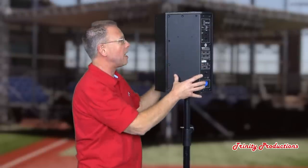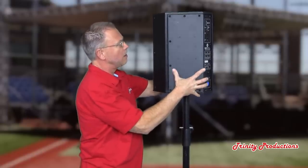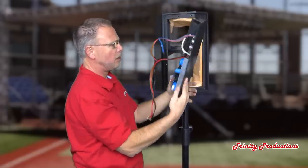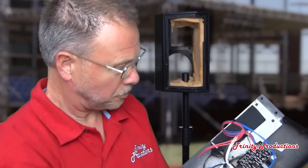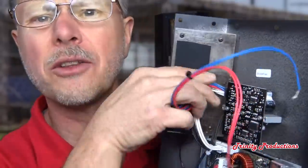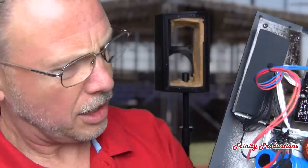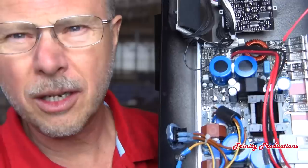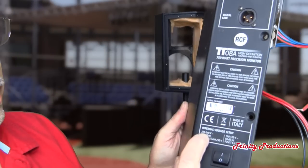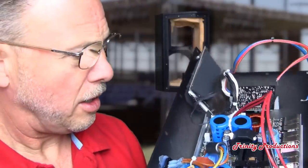We're back — we've got all the screws out of the back of the amplifier, so I'm going to reach inside and push it out and pull it off. Weight-wise, maybe five pounds. Getting it closer, you can see it's got a DSP section up here, an input section, and then the amplifier section. It utilizes a high-speed switch-mode power supply, and the voltage range is 220-240V or 110-120V, so it is a universal power supply.